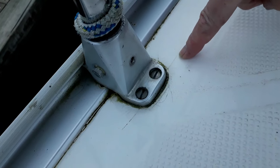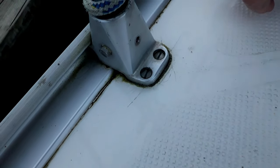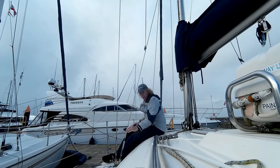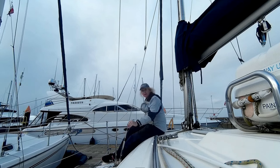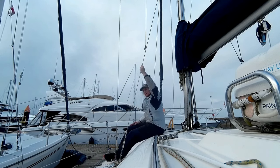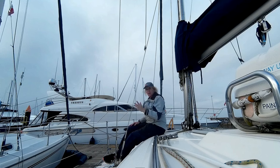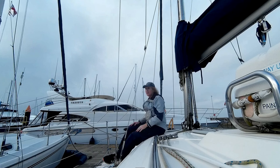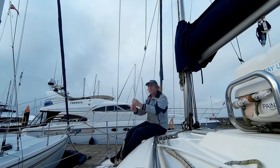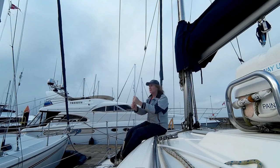An example of the kind of thing you can see when you're polishing your boat well are star cracks. They're not particularly excessive here on Salty Lass, but it's an example of something you can spot when you're up close cleaning. One easy thing to check is your rigging — down here at the bottom where it enters into the swages, you can look for cracks at the top. Another simple test: run your hand as far up as you can, and if you feel a bulge inside, it means a strand has gone and you need to replace it because sooner or later all the outside strands will go too. You can also look up the rigging for any strands sticking out.